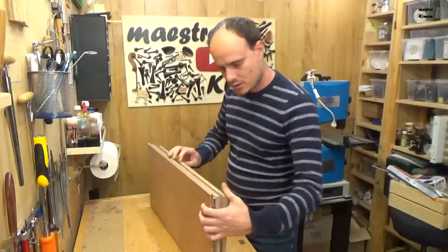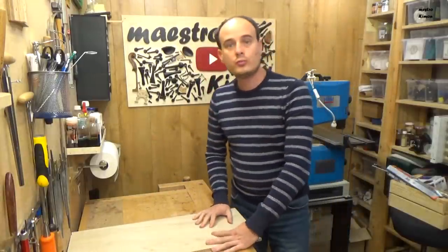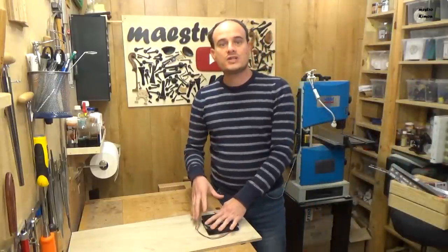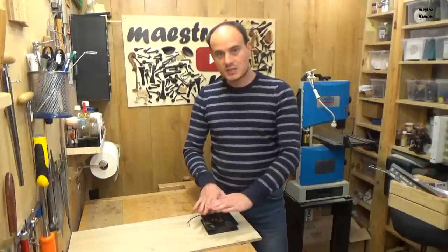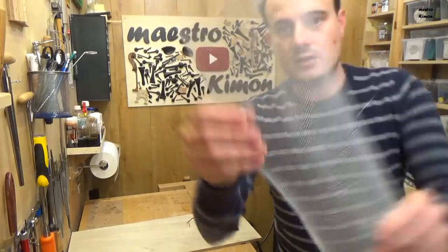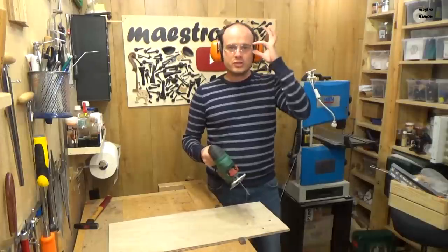I will start with the back side, which is the smallest piece. At the back side I want to put ventilation — this part will blow fresh air into the chamber for two reasons: first, to cool it down a bit since the lamp will be on for several hours; and second, the flow of oxygen helps the oil varnish to dry. So I have to cut a hole in the back and I will also make wooden sides to fix a filter — I'm just going to use some cloth and this net. Always use protection for your eyes and ears.